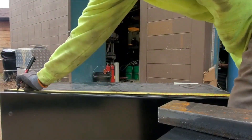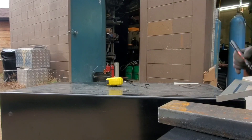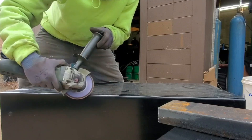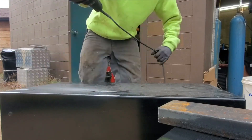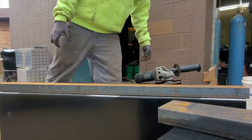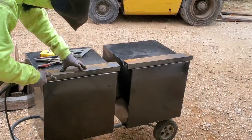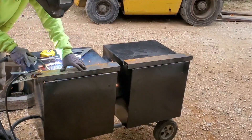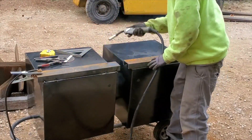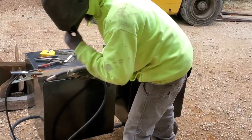I'm peeling some stuff off with the welding pliers and then giving it a little bit of love with a chipping hammer. The thing is good to go. So here's some layout, figuring out where it needs to be welded on, marking it all out, and some powder coat removal. Those boxes have some nice powder coat on them — removing as little as we have to to get a decent weld. Laying out the C-channel. Then there's nothing to it but to do it — tack it in place and then weld it on all solid. Remember, it's 309 wire we had from the last job in there, so it sounds and looks a little bit different, but it did a really nice job.